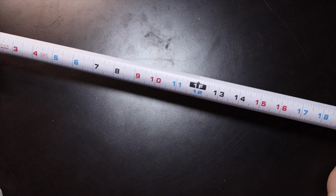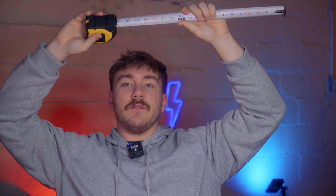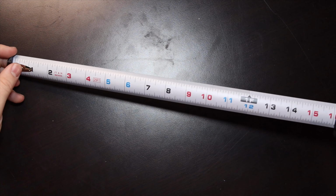Writing on the back is important because if you are measuring over your head, right? You don't want to have to flip your tape over, especially if you have a good sized standout, like you're 10 feet out. It's very difficult to flip it over. It just breaks on you. It makes it so much smoother if you can just look at the bottom, okay, you guys? And if you're an electrician, you're going to be measuring overhead. Lights are going to be over your head. Every light ever is going to be over your head. So having clear writing on the back is fantastic.